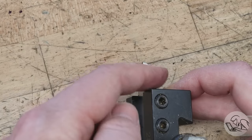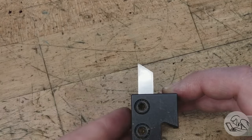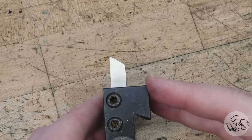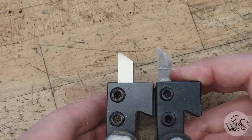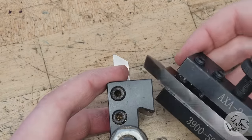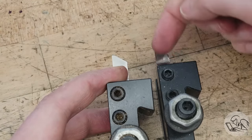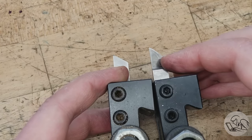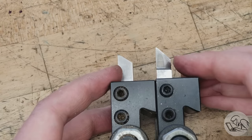What makes this a turning tool is that the cutting edge is right here, and the tool is meant to be fed against the work as the carriage moves sideways. This is specifically a turning tool for brass because it has zero top rake. Every material has a top rake angle that it wants — those angles are somewhat flexible — but in general brass wants zero degrees and most other materials want around 10 degrees. Stepping up in complexity, the next tool has a top rake angle: the top surface falls back and away from the cutting edge. That's a top rake of 10 degrees, so this is for cutting steel and most other things.